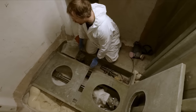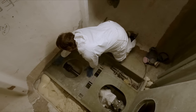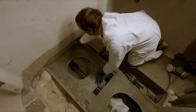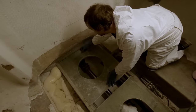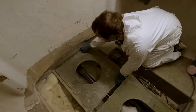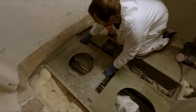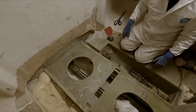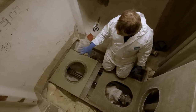So I just have a little bit of cleanup to do on this back bulkhead. I got a couple of high spots, so there's a bit of a gap here. I'll flatten this off a little bit. Might need to put a slight bevel on the back side of this, and we'll just tighten up that gap. Then we're not using a whole bunch of putty in there and essentially just wasting it. Yeah, we'll get that one fit.